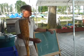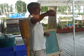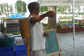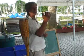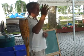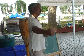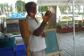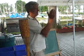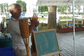Yeah, for sure. You're pushing the middle of the mast forward, right? When you're using the vang, you're just taking your boom and pushing as hard as you can. So that force induces more bend down low than up high. If you didn't have the vang at all and just really pulled on the main sheet, it's a more even bend, a little more up top. Most of that foot of bend will be in the lower part of the sail.